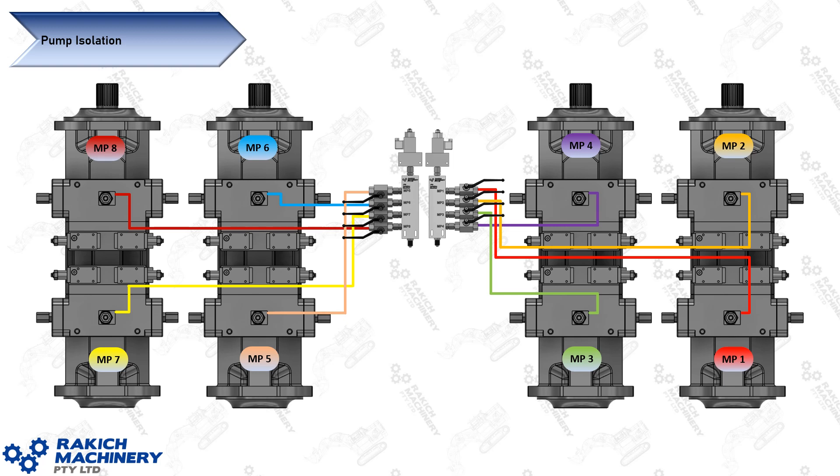When encountering any of these issues, the most common reaction is to replace the whole pump, simply because there's very little information available on how to accurately identify and correct these problems. Hopefully we address all of that here today. That's why we encourage people to use a PST pump isolation system. This is our manifolds and valves — we can supply these as a kit, or you can put a ball valve on each PST input into the pump. I prefer this method because the two valve banks are clearly displayed showing which ones are on and off, and they're numbered top to bottom so you can sequence the pump calibration correctly.